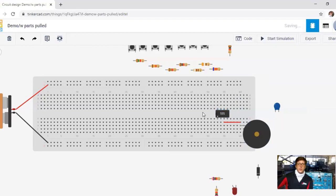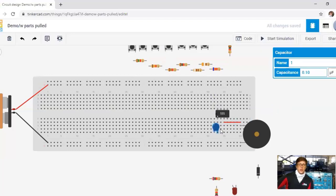The 555 timer bridges this gap — this side is all connected and that side is all connected but they're not interconnected, which allows us to use integrated circuits like 555 timers. The first terminal has a dot on it so you know that's terminal one, and there are eight pins total. 555 timers can actually create an AC signal from a DC signal — they have oscillator circuits, resistors, and all kinds of things inside them.